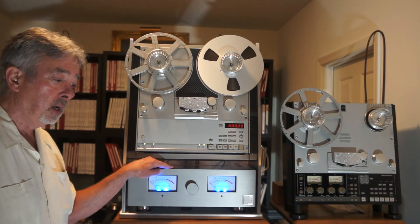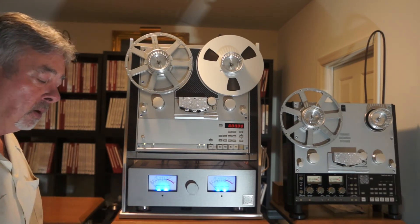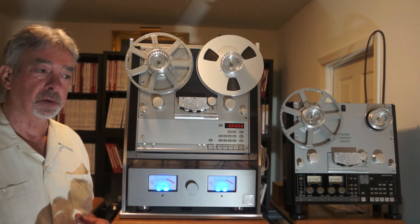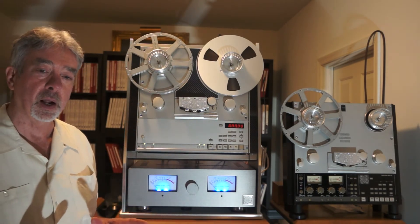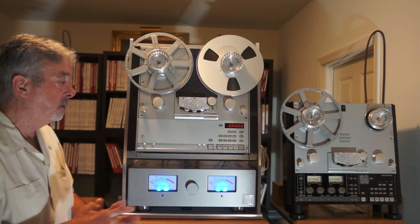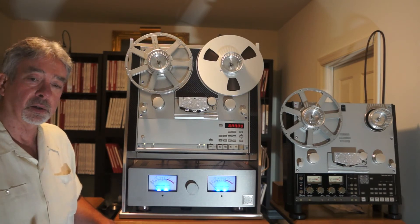You can experiment with other cables, but the cable I'm supplying with this should be your benchmark — it gives you a good idea of whether another cable is actually sounding better. What you want to avoid when cabling from the tape transport to the outboard head amp is using too thick or too low a gauge wire, because more wire between the tape head and the input provides more resistance. I have used thick cables and in my opinion they don't sound nearly as good. Just bear in mind that what you're trying to do between the tape transport and the outboard head amp is more like a phono cable, not an XLR signal cable.